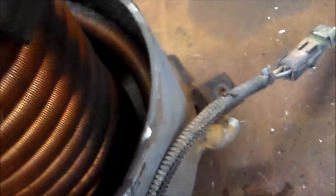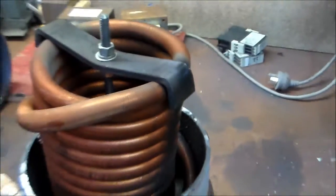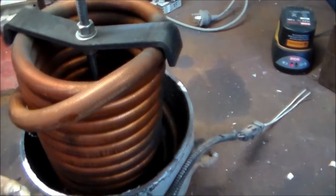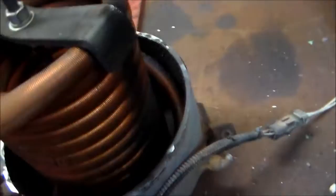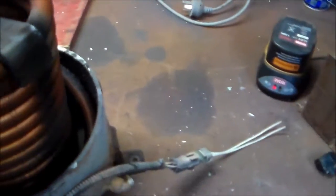And it's got all of this beautiful copper tube inside with the fin on it. What happens is when you've got all the containers on the boat, they're all too close together, so there's no airflow for the actual normal condenser to do its job. So what they do is they pump cold seawater through this coil, which in turn condenses the refrigerant, instead of having to do it with the actual condenser itself. It gets condensed by cooling water through here.